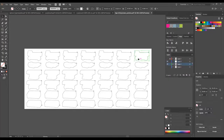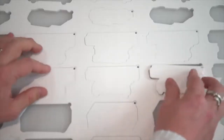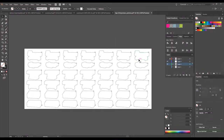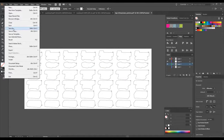For a laser cutter, all you need is the vector outlines of your designs. For a more in-depth or complex jig, you may need to create or have created a 3D model, which can then be used to subtract from a larger block. If you do not have the technology to do this yourself, you may want to partner with a local supplier that can create the jigs for you. Remember that you will need to use the same template used for cutting to generate your artwork file, and both must be scaled correctly — i.e. 100% to match the bed dimensions.